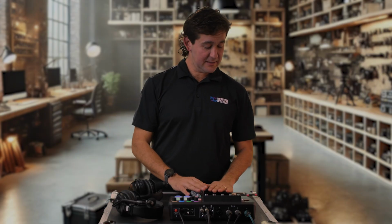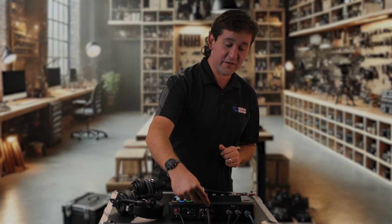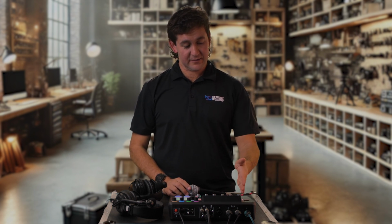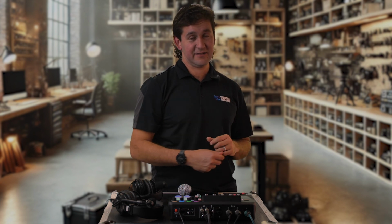So first of all, I want to go through all the equipment that I have. I have 2 Audio-Technica headsets. I got a nice handheld mic here. And then off screen, I have a studio monitor. It's a speaker. And that studio monitor is coming out of the headset for channel 1, which is associated with this mic input over here on the green. Channel 1 is for this mic, and this is for our producers, and the studio monitor is for our production team, so our switcher, our director, and our producer. And we're pulling the audio from the headphones out and sending it to the monitor.